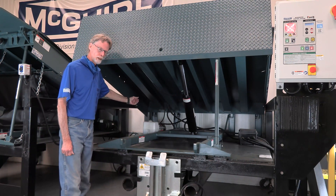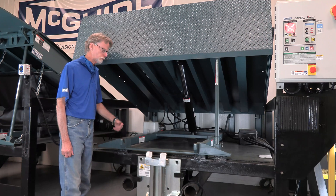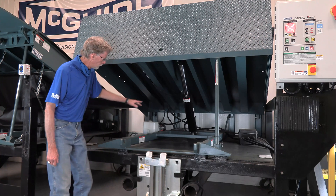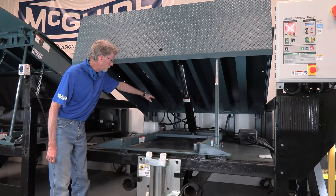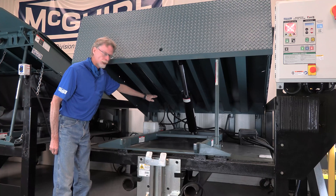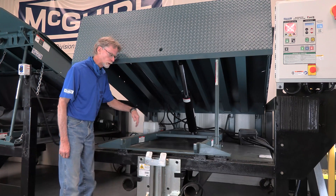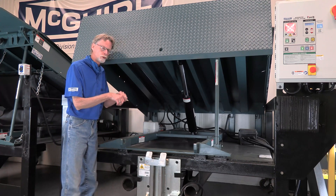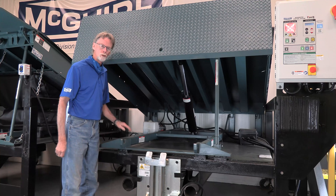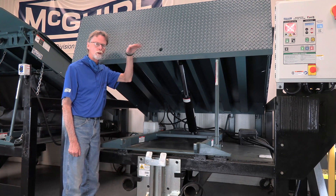The best thing to do, if something like that happens when you're in the field, is either call our tech service department or go into the manual — we have a specific section right in the manual that covers the adjustments on that power pack. This unit also has an optional e-stop and lip-out valve. What that does is: as you're controlling the leveler, you barely get it up out of the keepers, just above the truck bed, you hit the lip-out valve, and the lip opens up so you can let it down on the truck bed. That takes away the disadvantage of having to go through a full cycle to let that lip open — it's kind of like a quick cycle time.